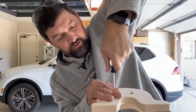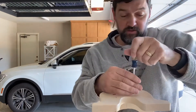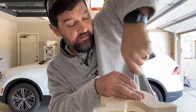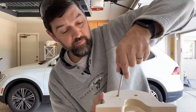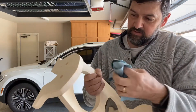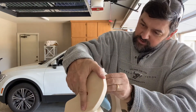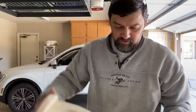I decided to use screws, and then I have a half-inch dowel to plug the hole and cut it off flat so it will look like there are no screws and should look pretty smooth once painted. The side is screwed in and glued, and now I just have to wipe up any excess glue. Where the glue's squeezed out means we've got a good bond — take a wet paper towel and clean all that excess glue out. With staining it's critical because it won't stain over glue, but with paint it shouldn't be as big of a problem.